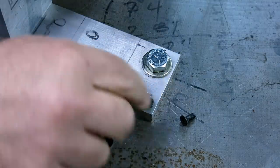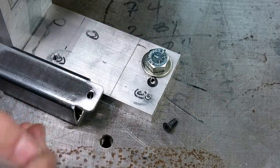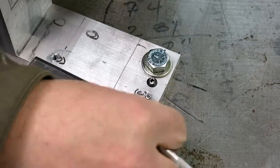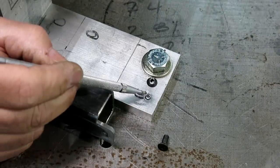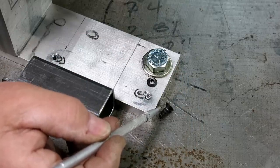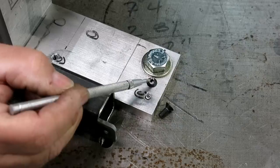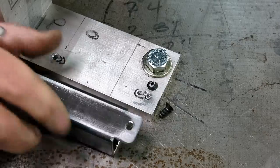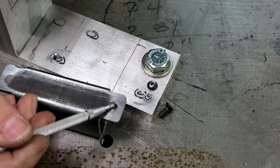So because of the depth of the socket, it's a blind socket, right? And just coincidentally, the thickness of this particular stock coincided with that spot. Normally you would put these, this is actually a little too thin even for this 82 degree head, in thicker material so that the full diameter of the fastener would see that shear force, right? So I don't know, just luck of the draw that it happened to be right on that line there. That's kind of interesting to me. And this one seems to be okay. There's a little bit of bozoitis there, where with the countersink, basically it's paper thin right there, right?